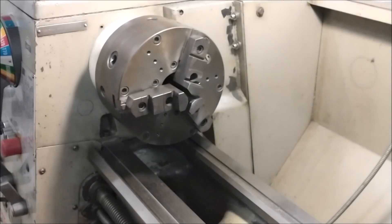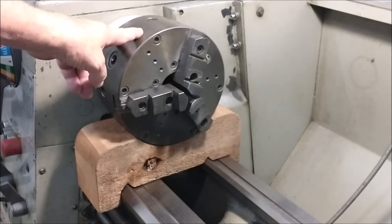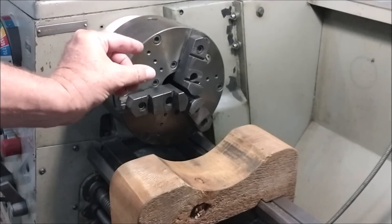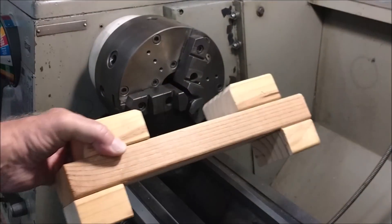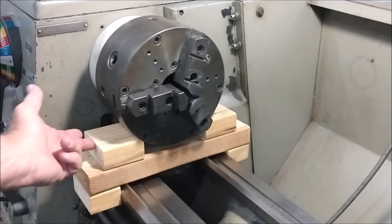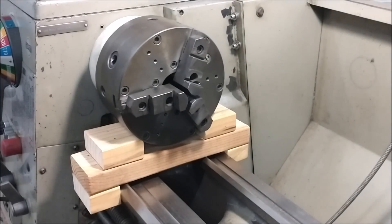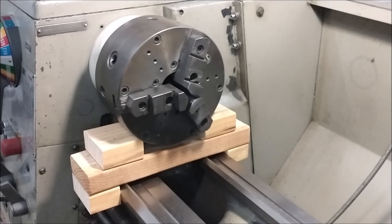A thin piece of wood isn't quite good enough, so I went overboard — got a big timber, cut it on the bandsaw, and made a nest for my chuck that fits like a glove. When the cams are released in the back, the weight of the chuck just sags onto this and I can slide it out like a drawer. If you don't have a bandsaw but have a two-by-four, put two pieces together like a door wedge until they come tangent to the outside and nail them down. The chuck will sit nicely on that slider and won't migrate down toward the bedways.